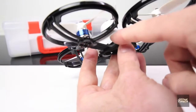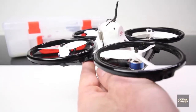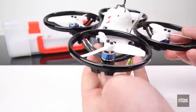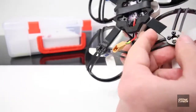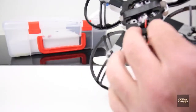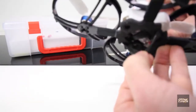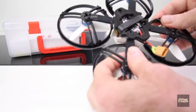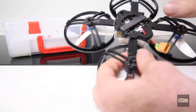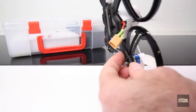Just below this canopy on the left is where the buzzer is — you can activate it on a switch on your transmitter. The frame is carbon fiber on the bottom, a unibody with a little piece of foam, and the classic King Kong style of putting the battery on the bottom using a rubber band. The setup works pretty well. We've probably got 3mm carbon fiber on the frame.